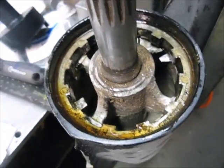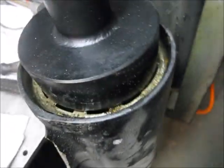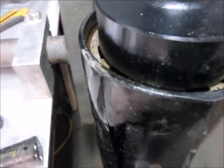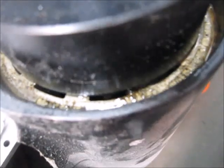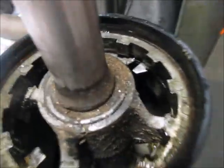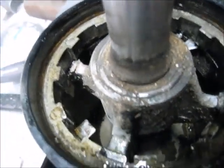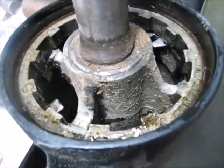What we've done is put the unit in here and I've used some impact and it won't budge. So what I'm planning on doing next is heating the outside of the case up with a torch to see if the four or five thou clearance will let this cover nut turn. Sometimes by heating up the surface, the four or five thou might give us enough to turn. If that doesn't work, then we just drill two holes and collapse the cover nut, which takes about two minutes.